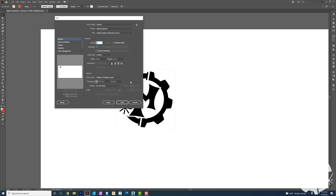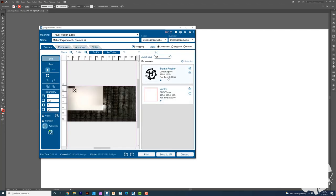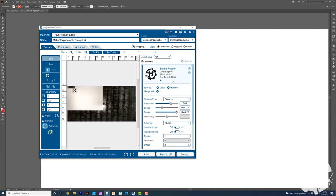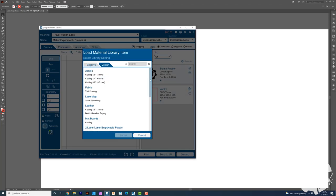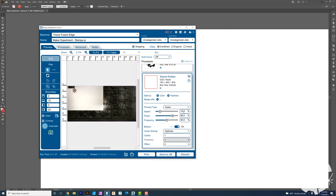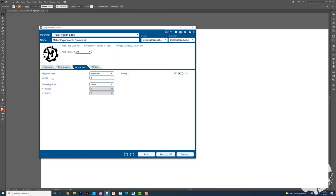I'm going to go ahead and print it over to my driver. In the driver I'm going to pre-select some settings I have for this odorless rubber. For the engraving it's going to be 25% speed, 100% power, 500 dpi resolution, and I am going to do it from the bottom up. For the vector I'm going to select 15% speed, 80% power, and 50% frequency. Over on the left under the advanced tab I'm going to go under engrave type and select stamp. This is what takes my graphic and does the inverse of my design — it sets it up for me so I don't have to do it myself. Once you have this, hit print and go over to the machine to print out the new stamp.